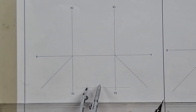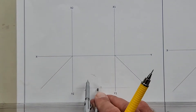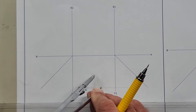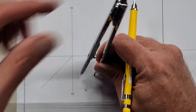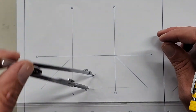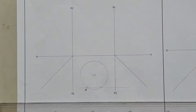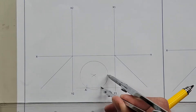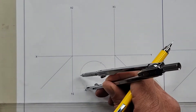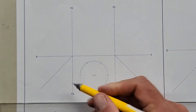There are a couple of ways to do this, but this is probably the quickest way — follow me. Take your compass, make a mark here, get a center, and on that position draw a full construction circle. Now, keeping that radius the same, I can just go tip and walk myself all around this hexagon.